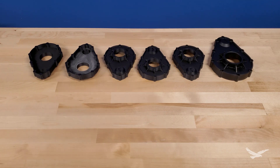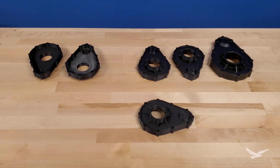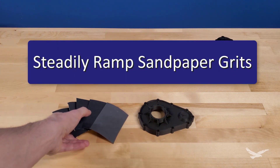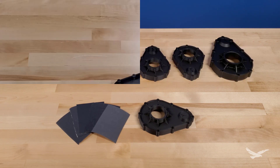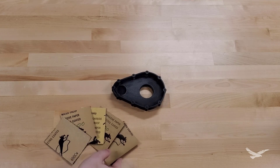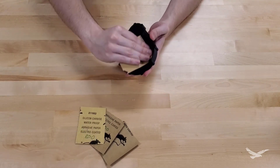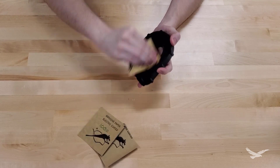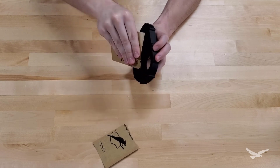While we do have a smoother surface now, what if you want it to be even smoother? Or what if you do not want to paint it, but would like the original color back? Well, one of the best options is to continue sanding the part with ever-increasing grits of sandpaper. After starting with our base 240 grit, we slowly progress the wet sanding by using 400 grit, then 600, followed by 800, up to 1000, and eventually ending on 2000 grit.